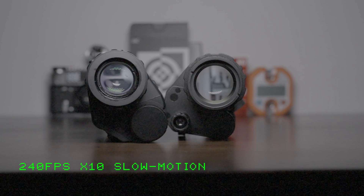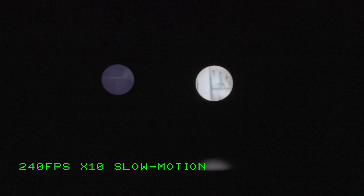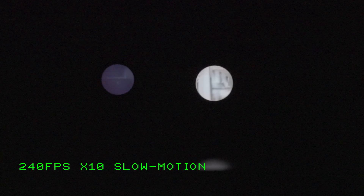We're recording both units at 240 frames per second and quickly toggling the lights on and off. Playing it frame by frame — this is the last frame where the lights are still on, and this is the first frame with the lights off. Recording at 240 fps means the time difference between each frame is around 4.2 milliseconds. In the very next frame, the ADNV G14P2 has already reacted to the lights turning off, putting its latency in the very low single-digit milliseconds. By comparison, we have to advance all the way to frame 23 to see the NVG-30 start to react in its 40 fps mode, giving it a latency just shy of 100 milliseconds — well under 10ms versus nearly 100ms.